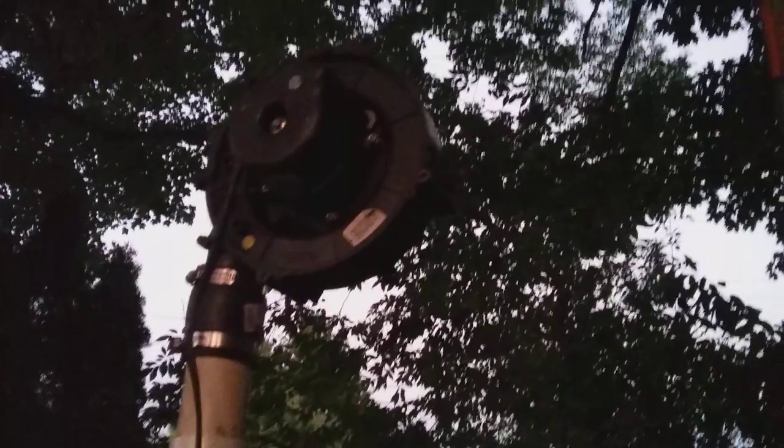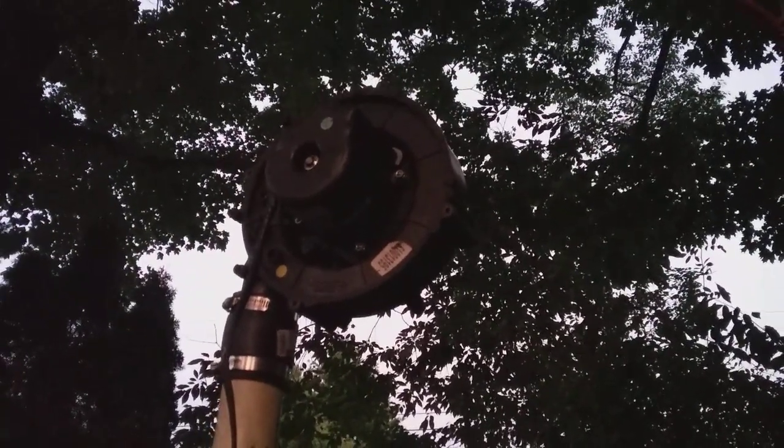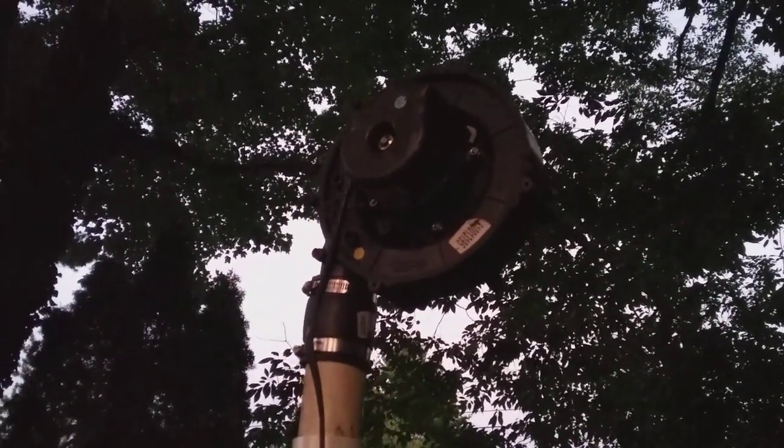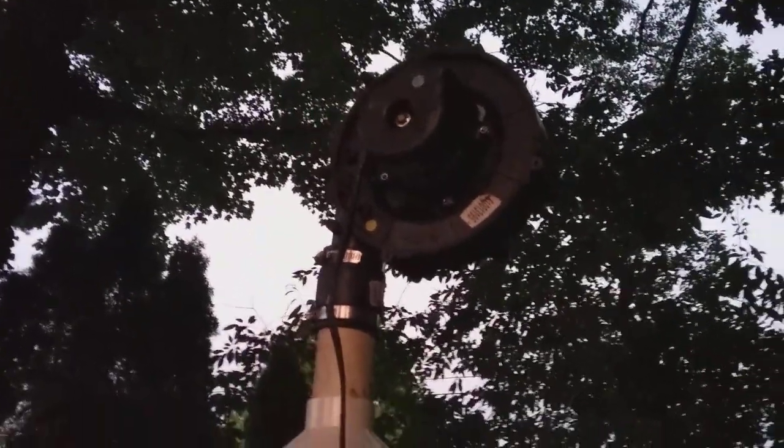What's powering this process is a 120-volt fan out of a natural gas furnace — actually designed for condensate, so I could run it in reverse and pull air through the system, but right now I'm just pushing it through. It goes into two-inch PVC down to a 90-degree elbow buried here, and then 100 feet of corrugated drainage tile with little perforations in it. The end is capped off with a plastic container and taped. It's all coiled in the bottom in a big racetrack pattern — going to the center first, then coiling outward.